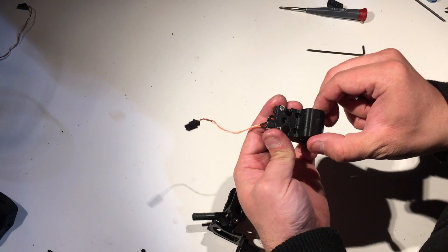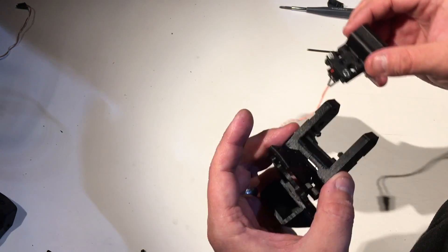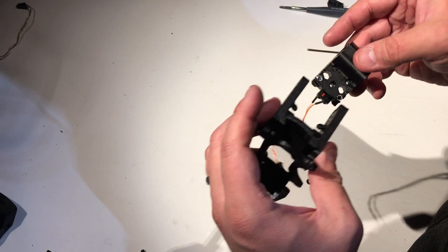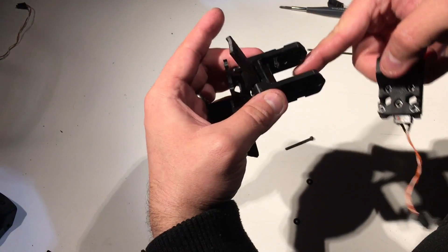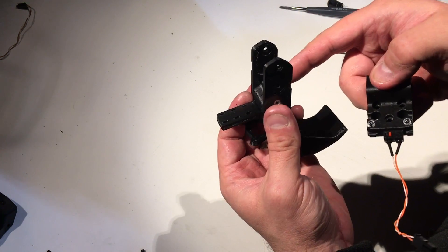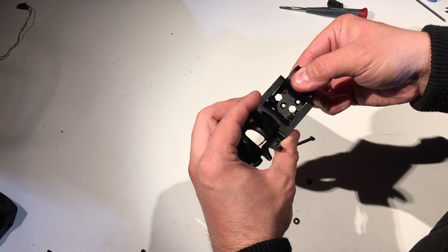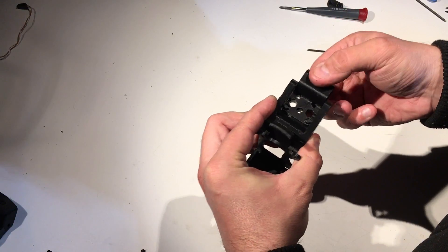You can keep it from wobbling while it's printing. These springs right here have a strike plate — a spring retainer essentially — that is what it tensions against in the other part of the carriage. You're going to come in at this angle here, have the springs depressed by these things, and then you twist it. These little nubs will catch on the other side — you'll feel a little snap — and it basically snaps together. Come in like so, catch the springs on both sides, press them in, pivot, and you're done.